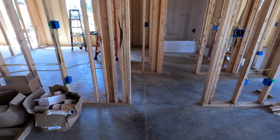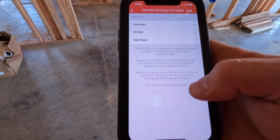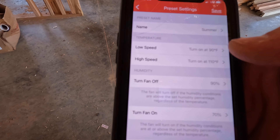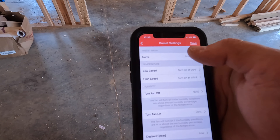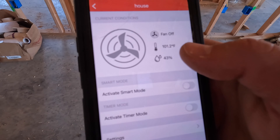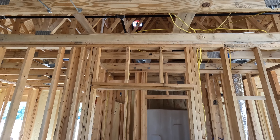It's probably getting close to 90 degrees outside today so it's pretty warm up there. You've got a bunch of different features — it's a two-speed fan. In the settings under climate, I've got it set so low speed comes on at 90 degrees and high speed at 110, but you can change those for summer, winter, whatever. If you want to get humidity out of the attic you can set it for that, and there's a timer feature to run at certain times. I'm going to activate smart mode — at 90 degrees threshold, with it being 101 up there, it should kick the low speed on. I'll hit the button and you can see she kicks on low.